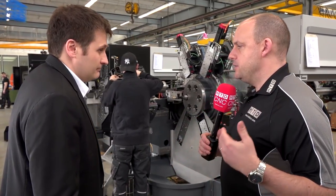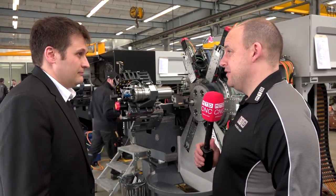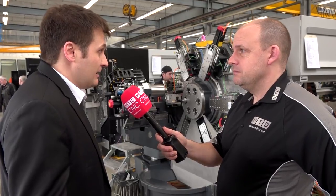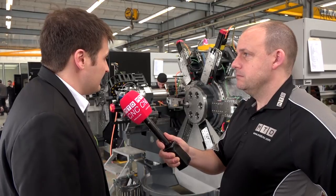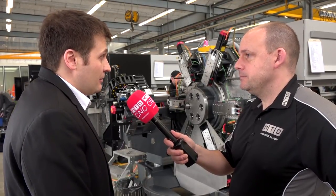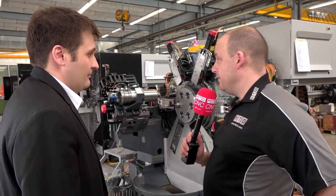It's great to see the quality of the machines being built here. Some common barriers to entry with multi-spindles in the UK are that they take a long time to set up and are difficult to program — but actually those are myths, as we've learned today. These machines can be set up in just a couple of hours to run production parts and programmed within minutes. That was basically the foundation of the Multi Swiss project — to create a multi-spindle machine that is easy to program and easy to handle, bringing multi-spindle technology to everyone. Now with the new 6x32, we cover a really wide range of diameters, and the 8x26 can make rather complex parts with a very easy to use and functional layout. Great to be able to bring this to our viewers — thank you very much Brice.